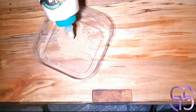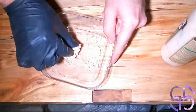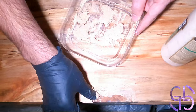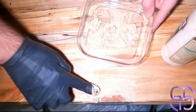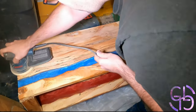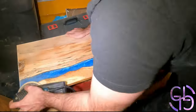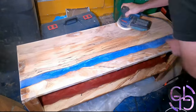After the glue dried, I realized to my horror that some of my joints were really bad — I just didn't expect that many gaps. So I did what I always do: I took fine sawdust from sanding this stand, mixed it with glue, and proceeded to seal every crack I could find. Once everything was sealed, I started sanding again from 80 grit all the way up to 2000 grit. By the time I was done I was covered in epoxy dust from head to toe. This took me six hours of non-stop sanding — probably the biggest sanding session I've had so far.